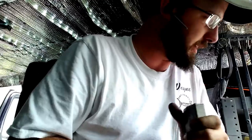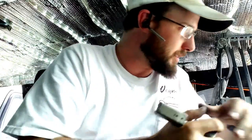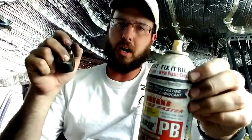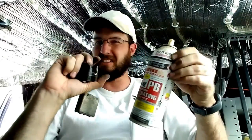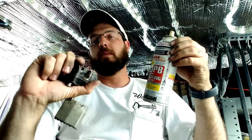Alright, so I'm just going to take these and spray them out with some brake clean. This one's actually dirty enough that I may go ahead and spray some PB Blaster. This is nasty stuff if you get it on you, but as far as cleaning locks goes, the best cleaning procedure is to go ahead and soak it in this. This is going to break down the rust, the grime, all the dirt and guck and buildup, and break it down into something more soluble. Then when we flush it out with brake clean, it's going to clean more of the gunk out of the lock.